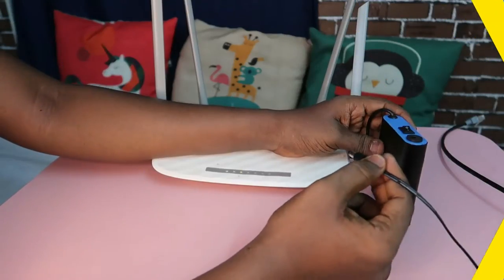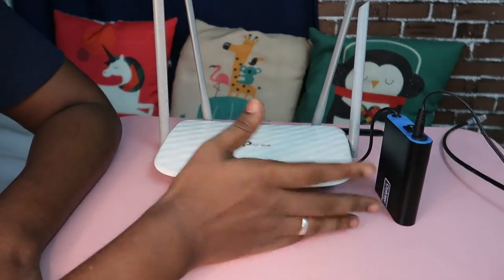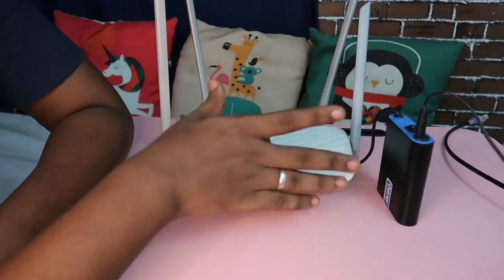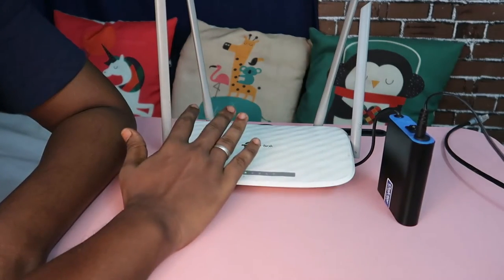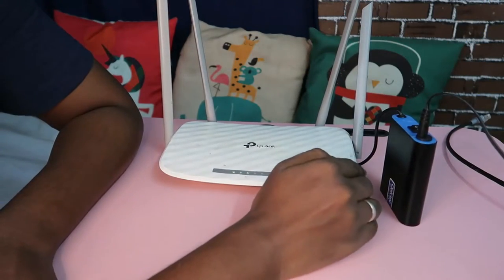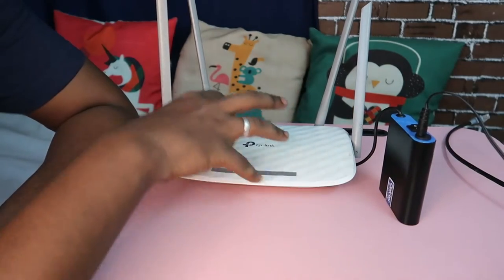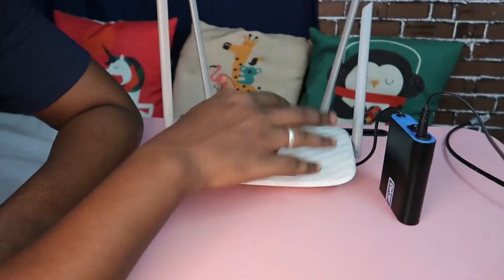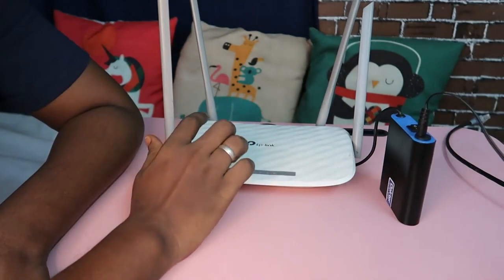When I re-insert the raw power, there's again no fluctuation or switchover interruption. It works on direct current and simultaneously recharges the 2600mAh battery. When power is available, direct power is supplied to the router while the battery charges; in case of power failure it switches back to battery power and the router continues working.